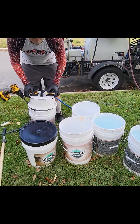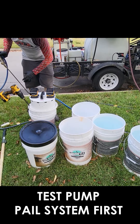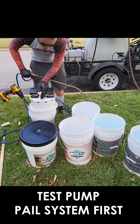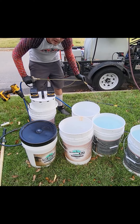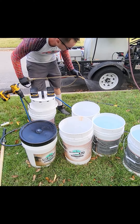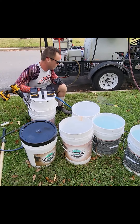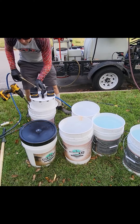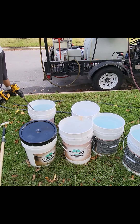The first step we're gonna do is prime the pump before we mix the sealer. We want to make sure that our pump pail system is going to work, so all we simply do is run it in water and give the system a little while to prime. You'll see that this starts to push through water and you'll hear all the air actually get out of it — we know that this is good to go. We're gonna move this over to another bucket of water just to hang out for a minute.